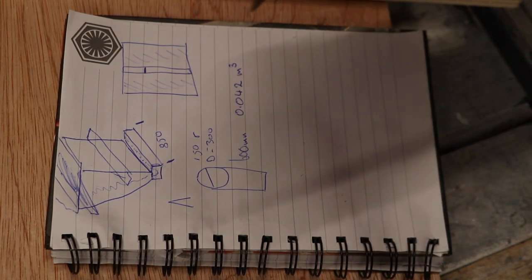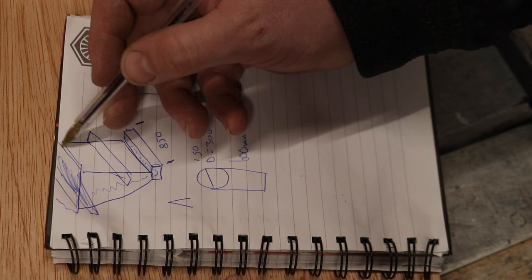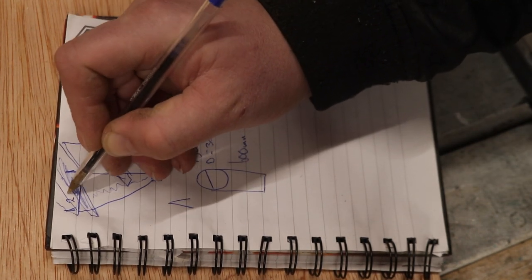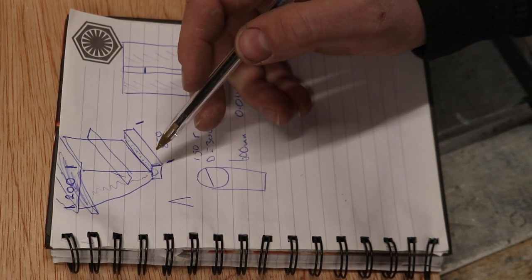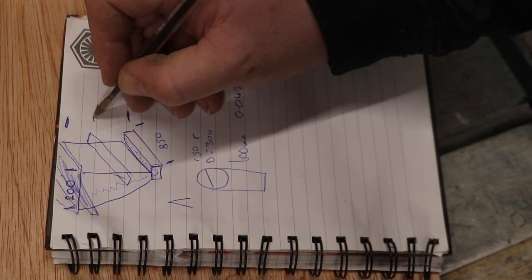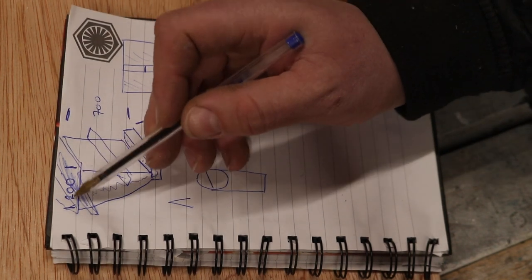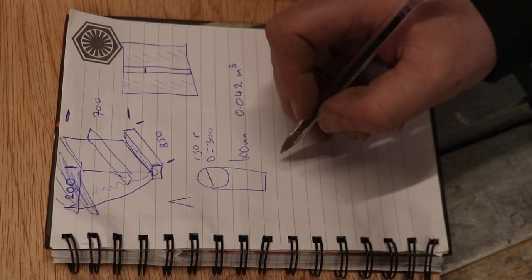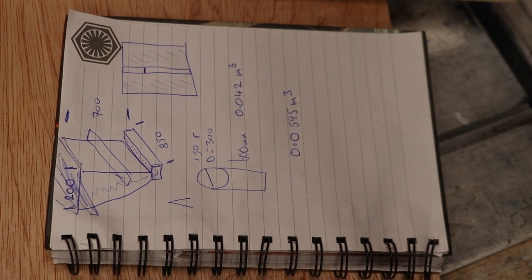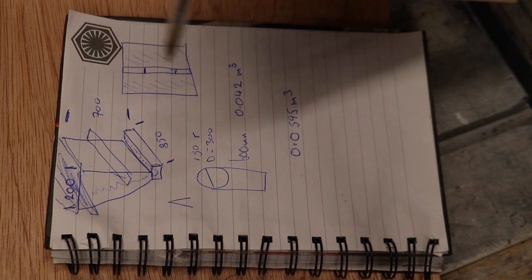Upside down, of course. So if we've got 850 wide, we've got zero there, we need to know the square base of our wedge, which we do. That measurement is also 850. And then if we go along to how deep we want this to be, from here to here, well, I've plugged in 200, I was just seeing what works, and 200 actually kind of works. And then the total height, we're going to go for a simple height, I think, of 700 mil. And plugging that into the calculator, okay, so we've got base width A, base width B, and then total height gives us a volume of roughly 0.0595 meters cubed. That means that we've got headspace, so there'll be room to add another bag if there's still some of the previous bag in the tank, hopefully.